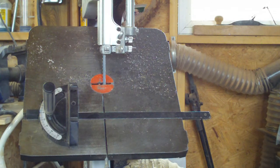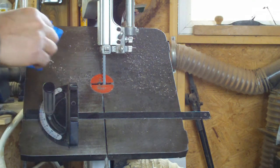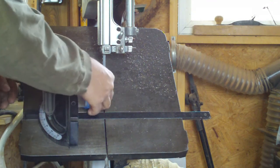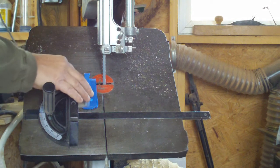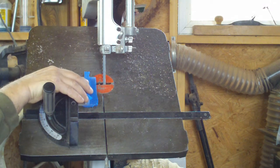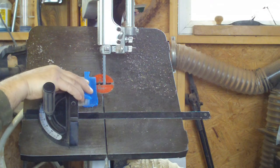The next step is to make these two parts identical. I tape them together so that wouldn't be an issue, and then I'm just going to run them through the bandsaw because that's a lot less aggressive than, for instance, the power miter saw. What I'm after here is that same split-the-difference chamfer — I'm just going to eyeball it.